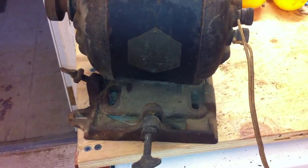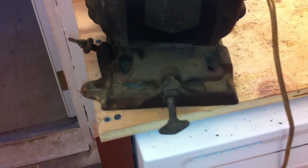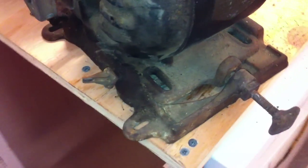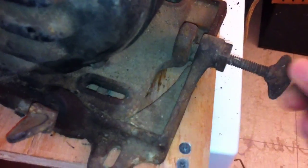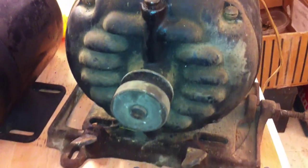Reversing these two leads on the posts should reverse the direction of rotation by reversing the relative polarities of the start and run windings. It came with this pretty cool base too — it's got thumb screws that let you tighten it down and adjust it. There's one for adjusting belt tension. Kind of an interesting looking motor — big heavy castings and cool grill work on both ends.